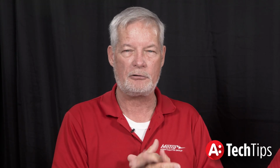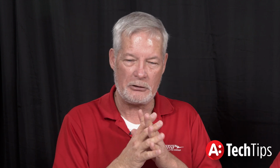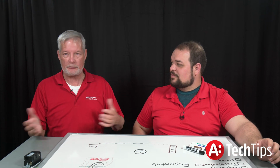So you definitely have to look at your high voltage grounding and your low voltage grounding. I encourage you to not pull that third prong off your cords. For testing purposes, however, I would have a floating adapter, because it will help you find where that problem is. Or have an extension cord, only for testing purposes, that has that pin broken off, to find out if there's a ground differential.